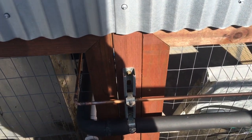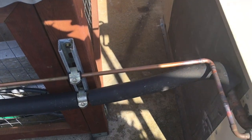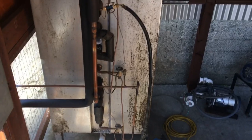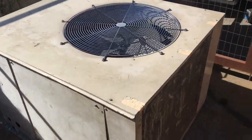What you see here — this is the organic brewery, so everything's recycled. We recycled the insulation and pipe from the last install, the Unistrut, the clamps. I heated up the pipe, took a conduit bender, and bent a little offset in there — kind of funky but it works. This is the same condensing unit that was up in the sky; now it's down on the ground. We'll let the vacuum pump run overnight, they're going to hook up the pumps, and tomorrow we'll get it up and running. We'll adjust the expansion valves and see if we can get between 8 and 10 degrees of superheat on that thing. It was a secondhand unit and it's been working great for them — pretty cool to see things reused.